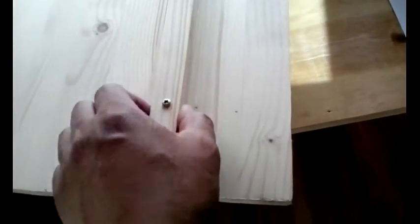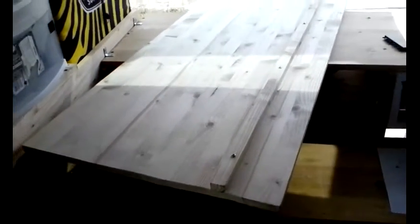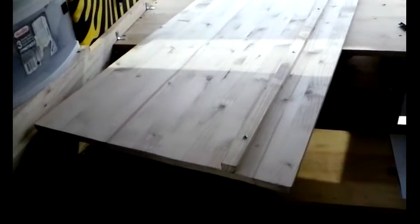The reason we have this bar here — you'll see in a moment when we put it down as the bench seat — it's designed to brace the other piece so that the backrest of the bench won't be vertical, straight up and down, won't be 90 degrees. We wanted it at a comfortable angle. I positioned the board at various angles, found what felt comfortable, then marked it, and that's how I determined where this bar goes. I placed it down now and as you can see it's a very tight squeeze. It lines right up to this support bar here that goes up to hold up the bedding section.